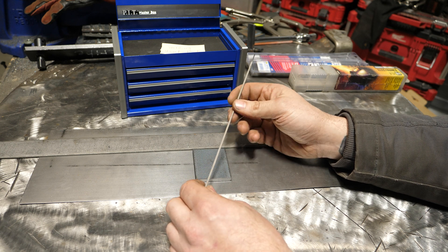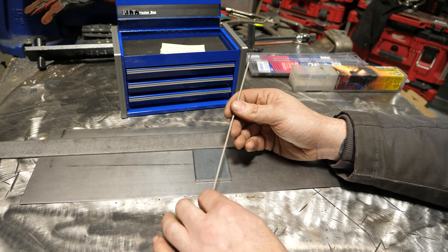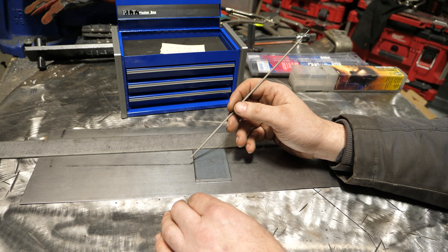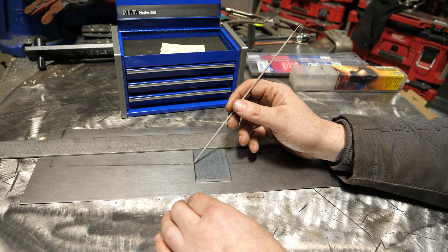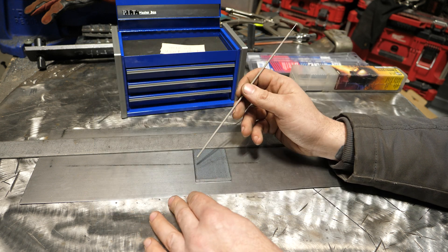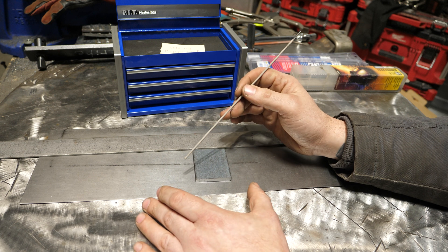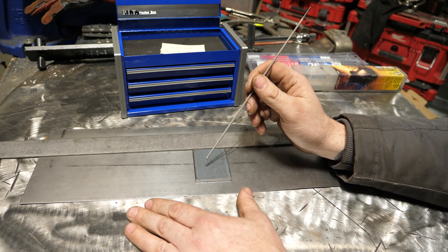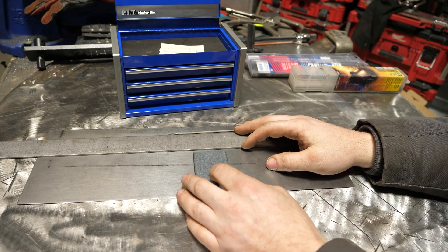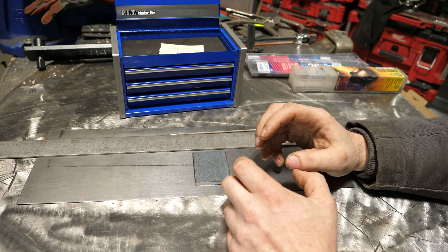Rod selection wise, I would personally try 6011 first. I find that these 6013 rods produce almost three times as much flux as you need, and slag inclusion is almost guaranteed. You have to run these at about 50 to 60 amps to avoid that slag inclusion problem. The trouble is that at those amps you're going to blow a hole straight through the 1/16th. It's a tough challenge — it's doable — but 1/16th to 1/4" is not something I'd care to do. Now, 1/8" to 1/4"? Definitely doable.